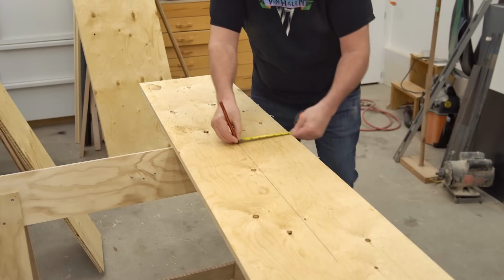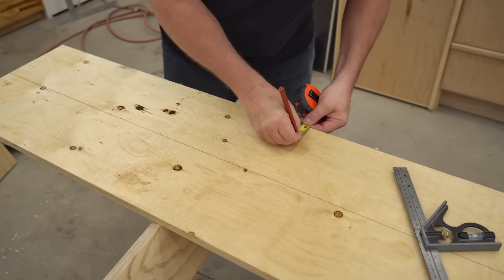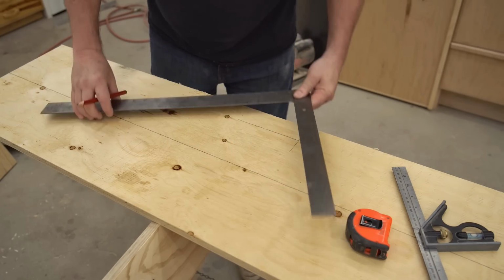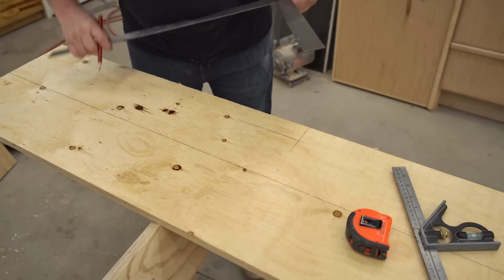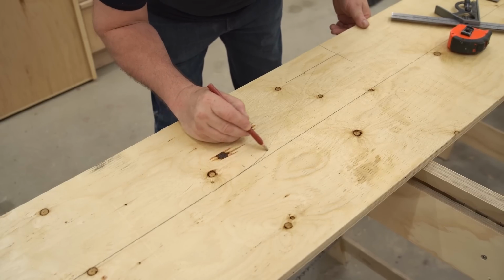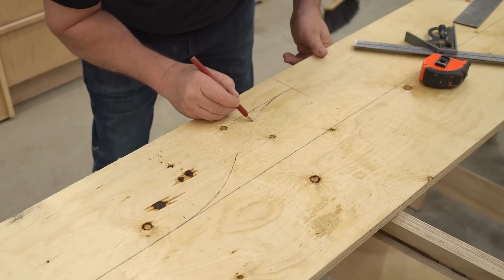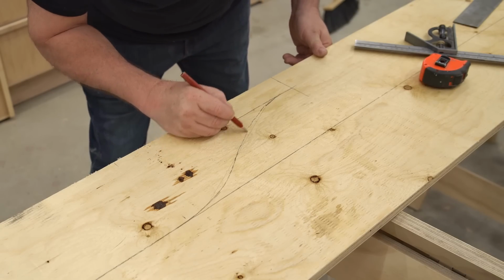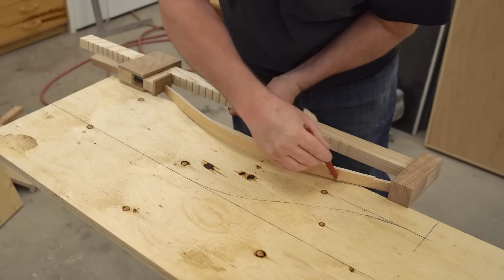Now the plywood that I'm using is 3/4 inch spruce sheathing. It's about the cheapest grade of plywood that you can get here. And of course it's not furniture grade, as you can see, but I think it's gonna be perfectly fine for this. So the first thing I had to do with this sheet was to cut it into 3 strips so that I'd have pieces that are more manageable and easier to handle. And then I started to lay out the parts.